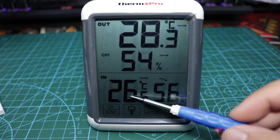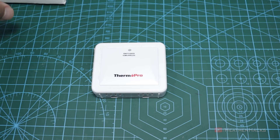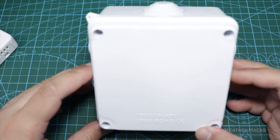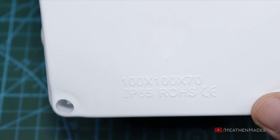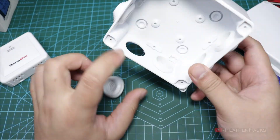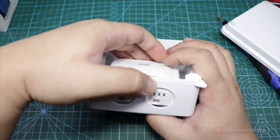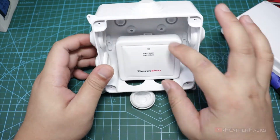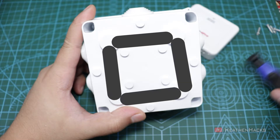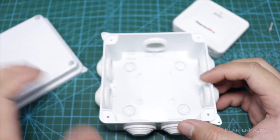This just goes to show that air conditioners are really effective at removing humidity from the atmosphere. Now as I've mentioned, according to the manual, even though the product is rain or waterproof, the sensors at the bottom still need to be protected. And what better thing to use as an outdoor enclosure than a weatherproof junction box? It eliminates the need to make a custom one and just requires some modifications. This is IP65 rated, which is basically weatherproof. We'll make some holes on the plugs for the remote sensor to have access to outside air. Since I'm planning to place it outside the window, I'm going to add some neodymium magnets here using superglue so it won't fall, and add matching magnets on the other side of the window to hold it in place. I'm also going to add a safety string so that if it falls, the string will catch it.